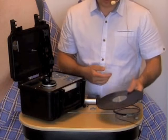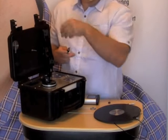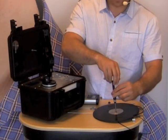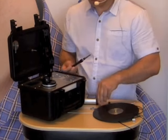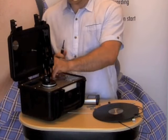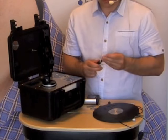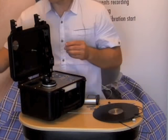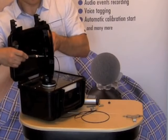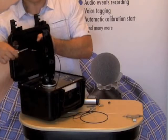Next part is to connect the accelerometer to the adapter. For that we have to use another ending of the screwdriver. We need to remove the screw from the seat part, then change the ending back again and use one of the screws to mount the seat part on the adapter. For now it's not really necessary to position the accelerometer — we can do it after fixing the screw.